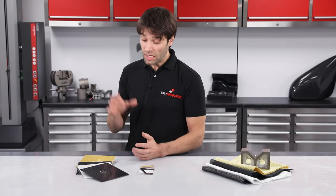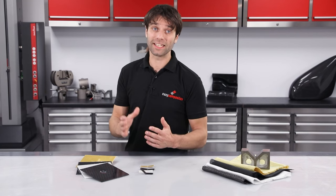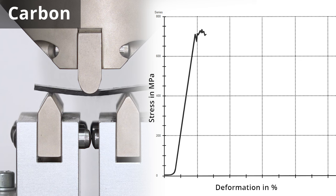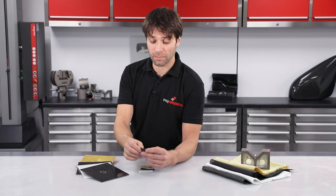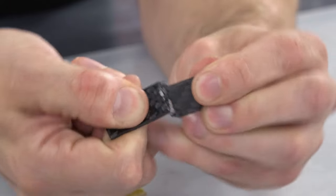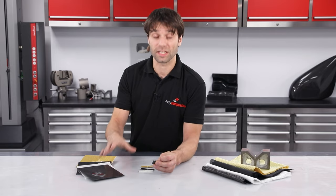Let's review the results, starting with carbon fibre. Carbon fibre's strength and stiffness were clearly displayed in the flexural tests, and as expected it fails abruptly — a huge climb in strength, then almost all of it disappears at fracture. In fact, I can just pull these broken samples into two pieces, which I couldn't do with any of the other materials. So in this application, where outright strength and stiffness isn't the only requirement, carbon fibre probably isn't the right choice, and we're going to discount it.